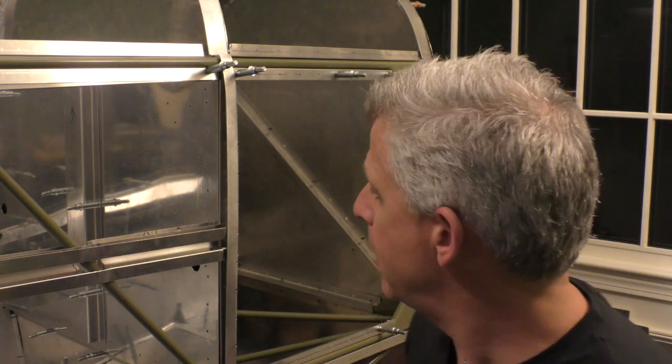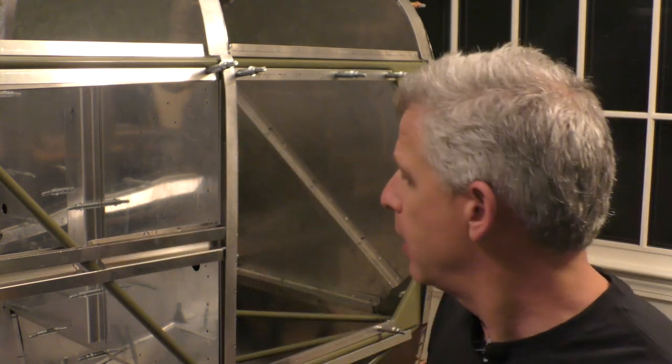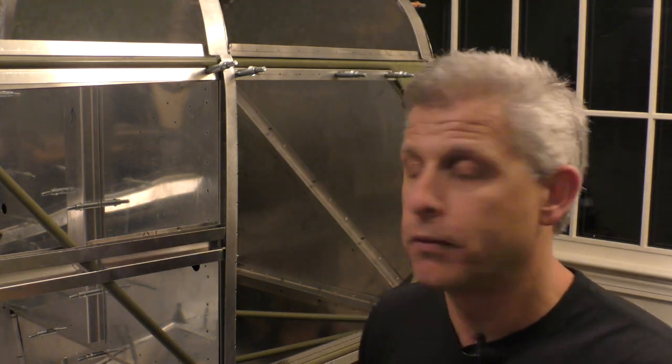Okay, so now we've finished what is probably our first truly complex part of this aircraft structure on the T-51D Mustang, and it's this double-walled station number 3 bulkhead. A little complicated because we had a lot of different things we needed to accomplish. We needed to be able to use both hat sections and U-channels to allow us to sandwich this welded structure of the aircraft and provide a wall on the front and the back, be able to cleco and create a solid structure out of that, and also provide reinforcements so that we could put the rudder pedal connections in place.